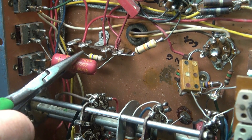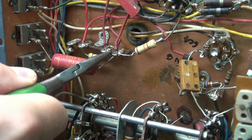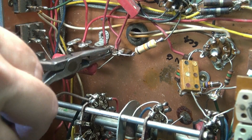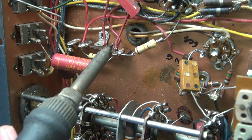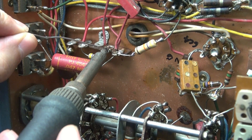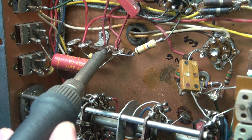When you're replacing these components on these terminal boards, make sure to take your lead through, twist it around, crimp it in place. You'll see on some of the amps that you run across that people just stick the wires through and solder them, but that does not give you a good mechanical bond.